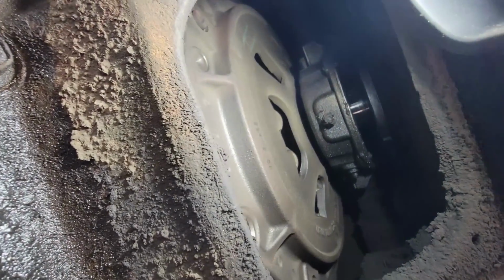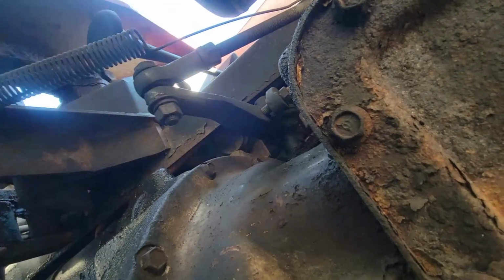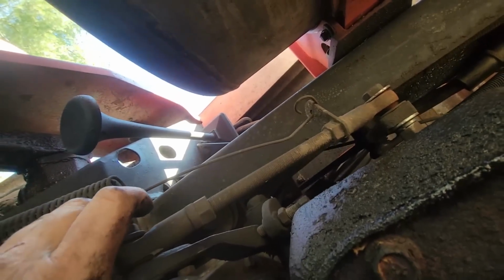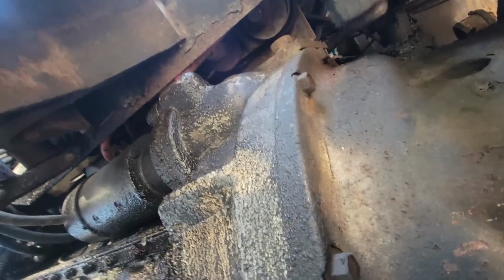So we're gonna have to adjust the clutch, and we replaced a bunch of the bolts in here and drilled out the heim joints for bigger bolts so that they weren't as sloppy because everything was worn. And then there's a pop in the front end when you make a left turn, or a turn he says, I think I see it right here.